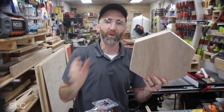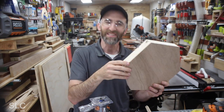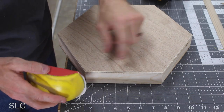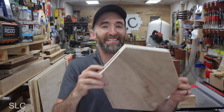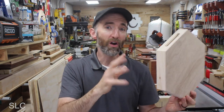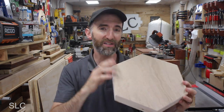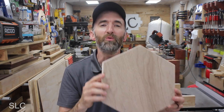To smooth out the rough edges I'm going to use an eighth-inch roundover bit in my palm router to make quick work of this, then use a hand sander to finish off any remaining burrs. This is nearly complete and it's getting really exciting! At this point I definitely recommend putting on some kind of urethane, lacquer, or similar finish so the oils from your hands don't discolor the wood — plus that finish will really make the grain stand out and look great.